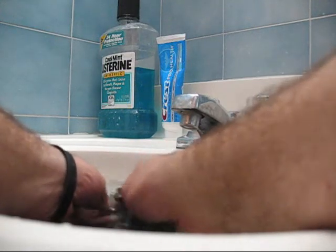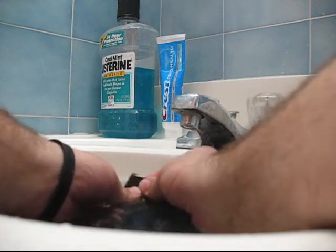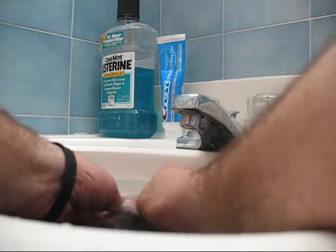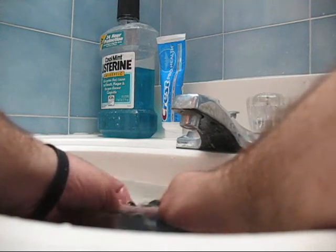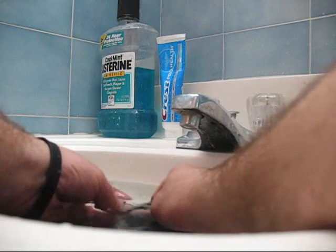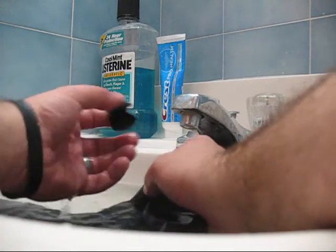Anything finer really won't do much to this. Sand it down real good — get the whole surface, because anything you miss is going to peel right there. Try to also use a paint that's for plastics. I'm not using a plastics paint, but it'll stick just fine. Plastic paint does work better and lasts longer on plastic, but it's too expensive.